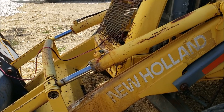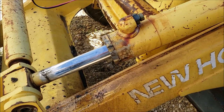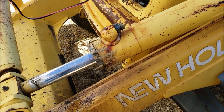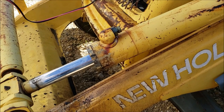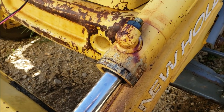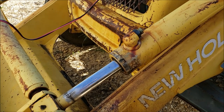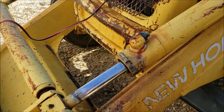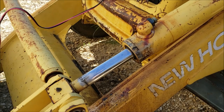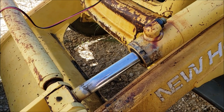This is the first part of the video explaining getting these caps off. If you torch it and you can't get it off — I've seen videos where they've torched the heck out of it, completely burnt the paint off — I would be worried about warping that tube. That's a common method and people do it, but I just didn't really want to do that. When I read about this peening method that actually just slightly loosens up this end of the tube, I wanted to try it. Sure enough, this guy swore by it — he said he's been doing it his whole life. Some have to be peened more than others, but it always seems to work. Now it's turning like it's not that big of a deal.